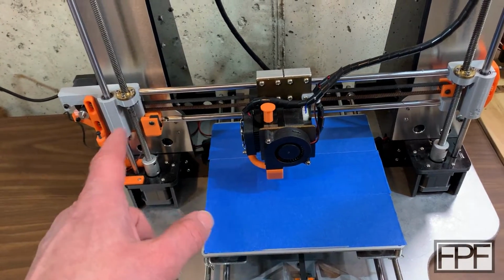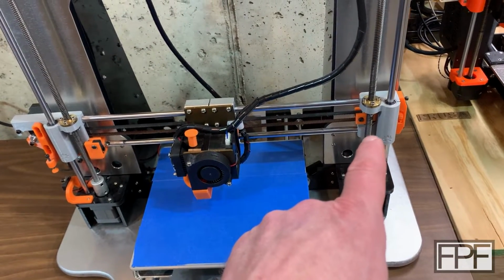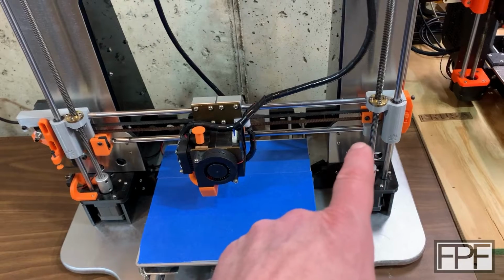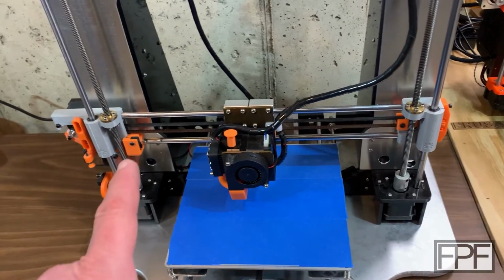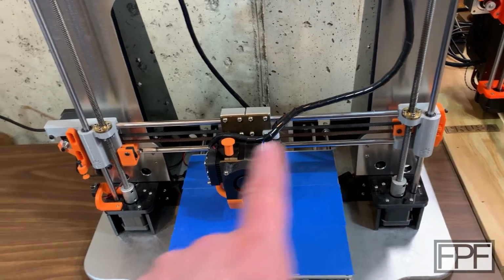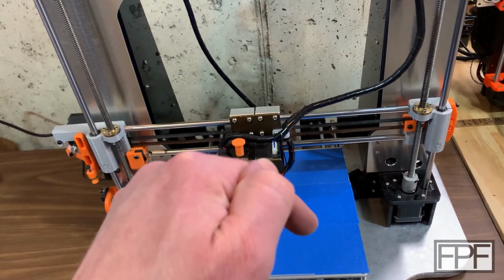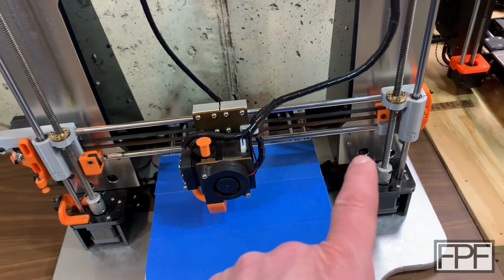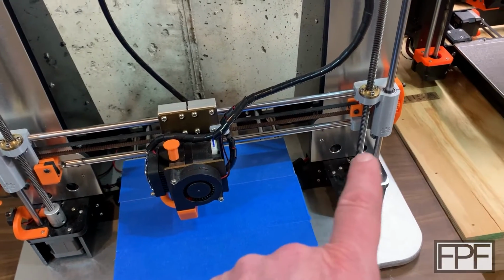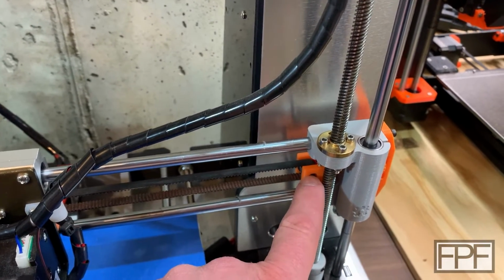The upgraded x-axis on this machine is the smooth x-axis for Prusa i3. I had to make some adaptations to get it to work on this machine, but I was able to find the original Thingiverse link for the smooth x-axis that I downloaded, and I will make sure that is linked down in the description of this video. If I recall, the key pieces that I needed to make to get it to work on the ANET A8 were a longer tensioner rod here.